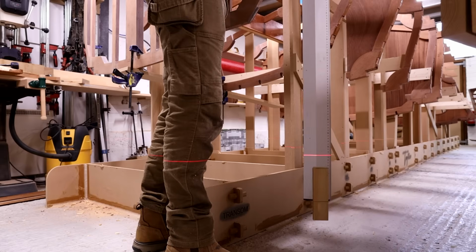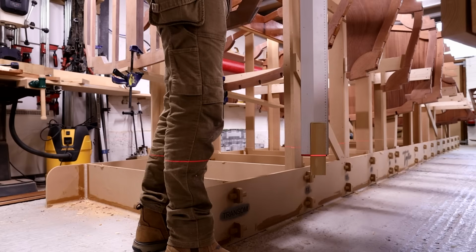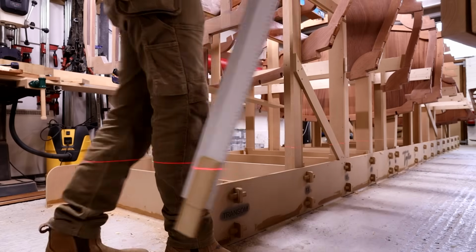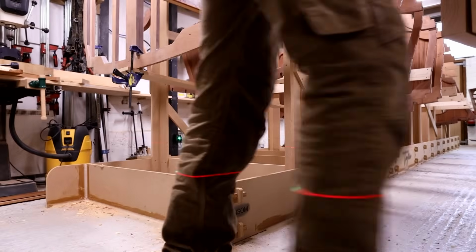But you can just see here that I can get that laser right on that line, and it makes it really nice and clear when the ruler is zeroed, and I can then reference the height with whatever I'm measuring throughout the boat. And I've done this several times. It's a really useful check just to know where parts are and that they're at the correct height all round.